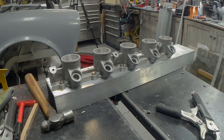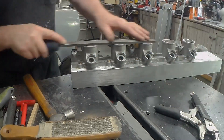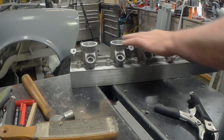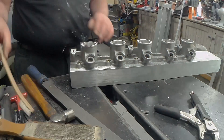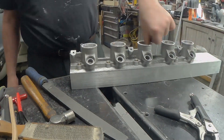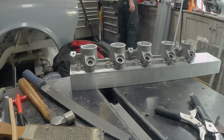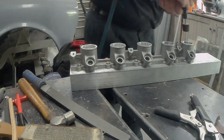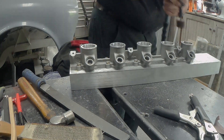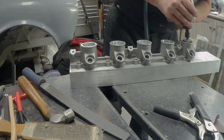Cleaning and tidying it up, and there you can see we're now ready to go. The manifold part with the injector bosses in it is just a cast piece, so it's a little rough. The casting actually welds pretty nicely — no porosity in it. Volvo makes the casting and it's really high quality. You can't weld through the aluminum oxide, so the cleaner you get it before you weld, the better off you are. I'm going to finish the little bit of port work, make sure that's nice and neat and tidy, and then put a good big weld prep chamfer on the ends of those tubes.